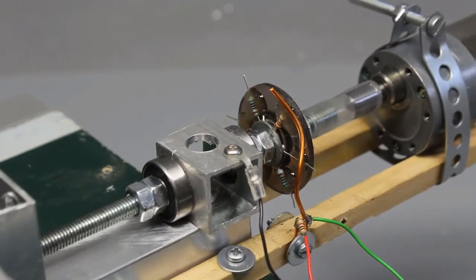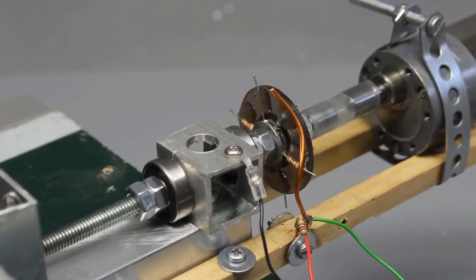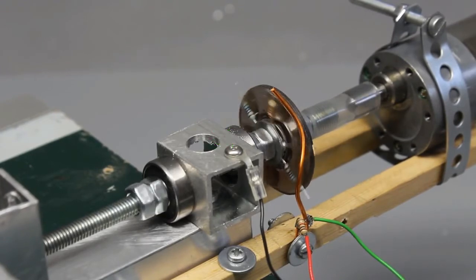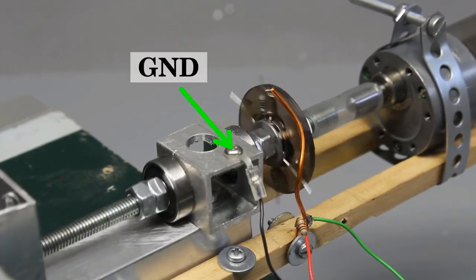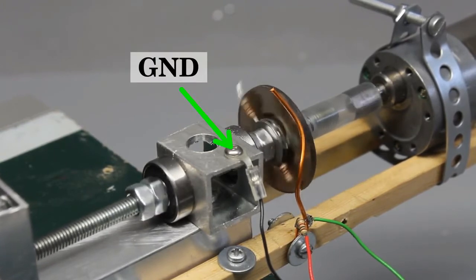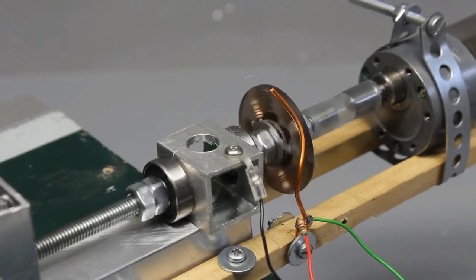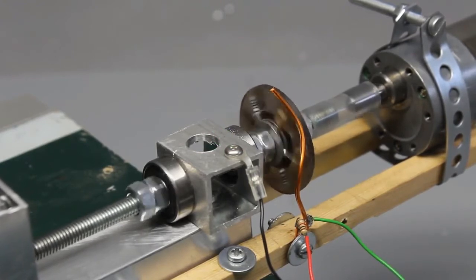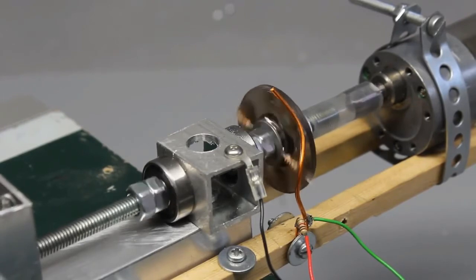We can also use the rotational sensor composed of resistors in the control circuit. Instead of using a second wiper, the washer side of the sensor is pulled to ground through the ball bearings, whose resistance is obviously low enough. Contact bounce is a huge drawback of this type of electromechanical encoder, limiting the maximum revolution speed.